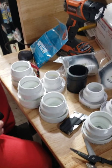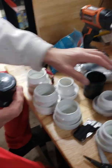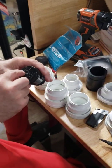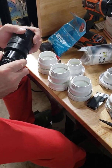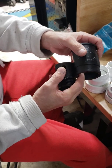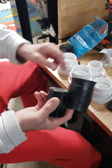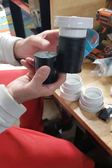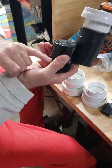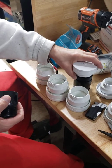What I'm going to do is take an adapter and drill holes around the outside of these cheaper air admittance valves that already exist in the home. Then we're going to slide this down over the top where it will breathe through those holes, and put the new valve on top. So it's going to be a triple valve — a single valve here and a double valve here — and that should solve the problem.